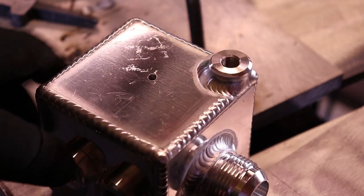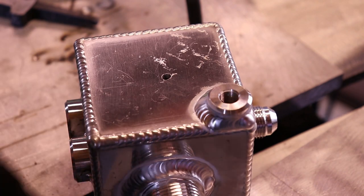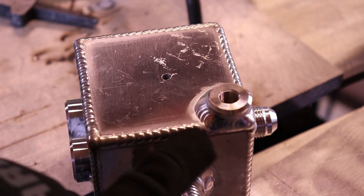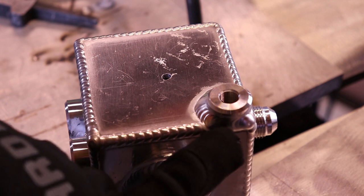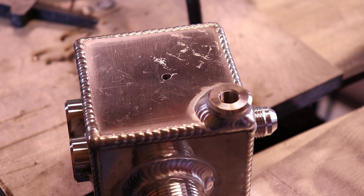This one I didn't let cool down, I just went and tried to weld it up real fast. When you're doing the sides like this, you're using a lot less amperage than in these fillets. The camera that I had positioned on the welder to show you the amperage readout wasn't turned on.